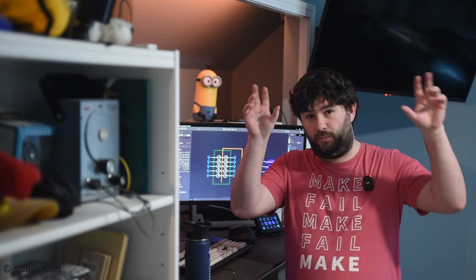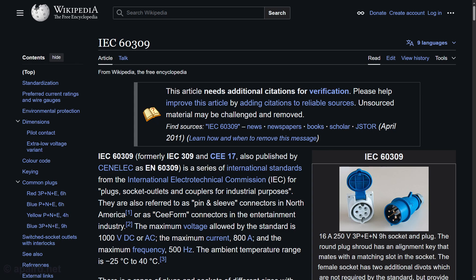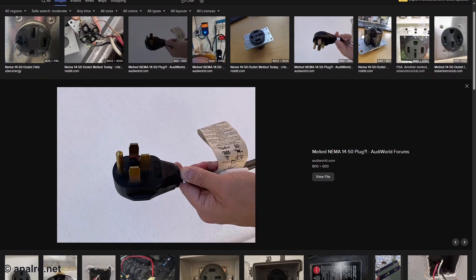I found essentially three different types of systems I could buy. The first would be something like an EcoFlow or an Anker — a portable battery, really heavy, but portable. Some of the large models like the large Anker or the EcoFlow Delta Pro or Delta Ultra have quite a lot of power capability and could easily handle the load I need. However, they're portable so they're not hardwired in. These companies all make some sort of automatic transfer panel where you plug a proprietary cable from their transfer panel into their battery. That means I'm tied to using their battery, and it seems kind of weird to have a proprietary connector on a portable system.